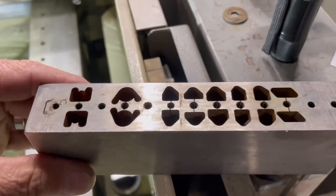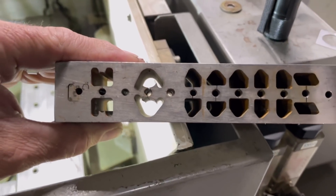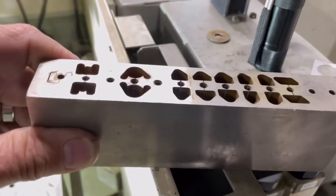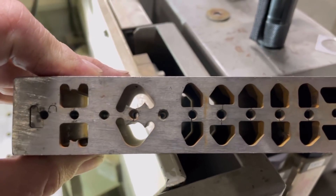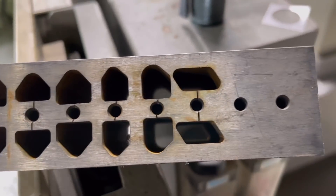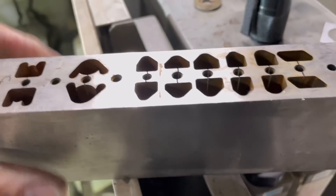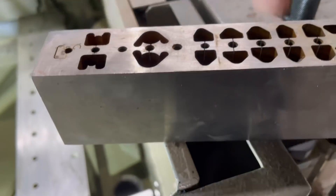You can see the kind of work this machine can actually do. There is zero taper in this part — you can see how thick it is, an inch and a half — and this thing can cut those right out. You can see it actually slices in between parts to cut the next part, then drops that out. This thing made a die, so the pieces that came out are the pieces that are actually going to be stamping into another part.